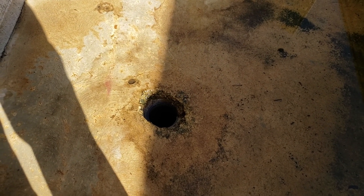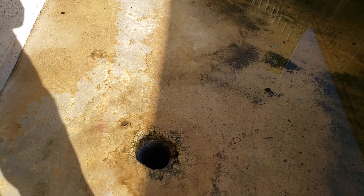If you did have a blockage and the cap was glued in place, it would come out at the lowest fixture — typically the closest bathroom: bottom of the toilet, bottom of a shower or tub. But if you're not having any drainage problems, it's not a loose cap. We're going to pipe-thread Teflon tape the cap and put it back in.